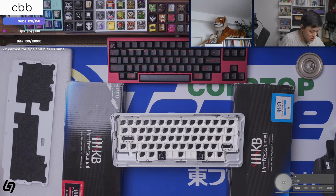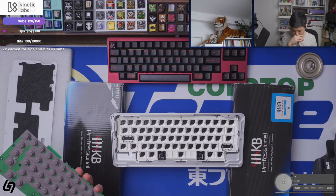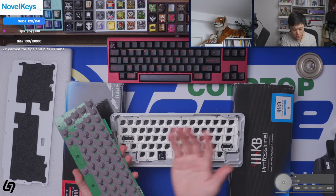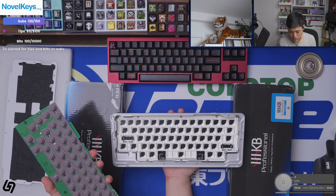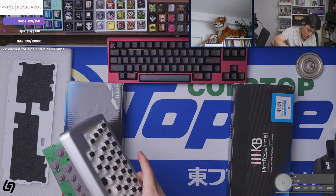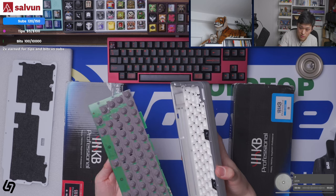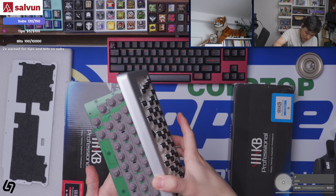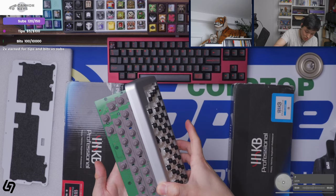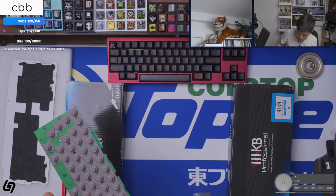Okay, so now it's time to put our PCB. There are several ways of doing this. One way is just to kind of flip it over, but gravity would push all these domes down. So what I'm actually gonna do is carefully lower the top of this onto the PCB, but you need to be pretty careful so that you don't end up pushing the dome sheets and dislodging your conical springs or any of the parts. So you can be pretty careful about that.